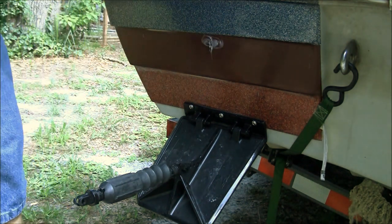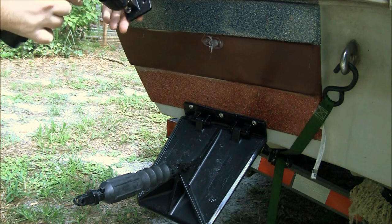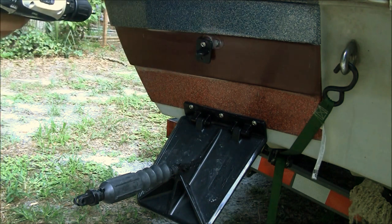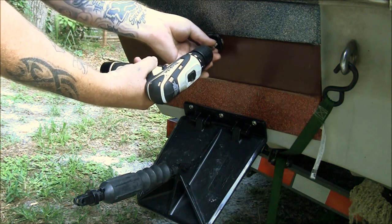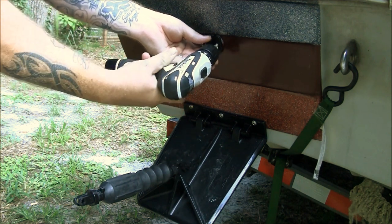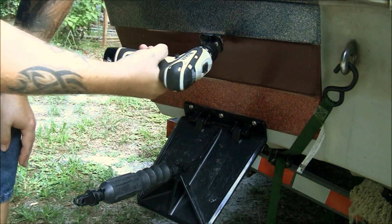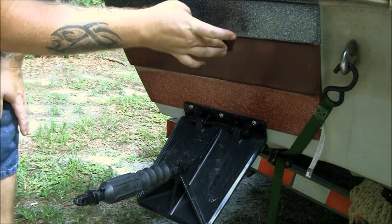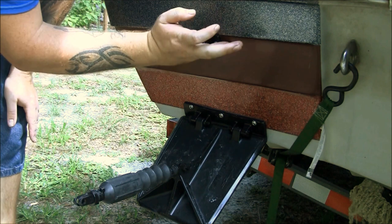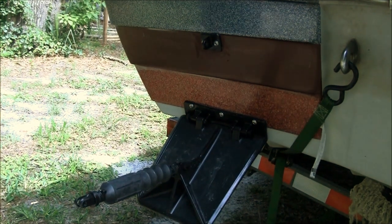Again, you can't ever have too much silicone. Go ahead, take a drill and start the screw, then start your other screw too. Go ahead and tighten it down, wipe off your extra silicone, and move it around the edge to get a good tight seal. All right, now you've got that done.